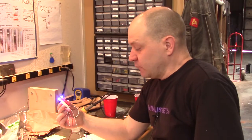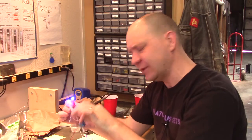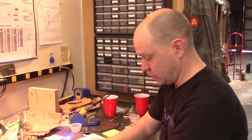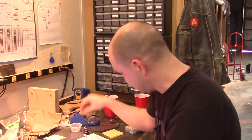I think I got it. In a series circuit, voltage has to add up to get to your power supply. We have 12 volts to work with, so we're going to do two 3-volt LEDs and one 5-volt relay - I'll be adding resistors later. They are all in series right now, and when I break the circuit the lights go out and the relay quits firing; circuit it up, the lights come on and the relay fires. What this means is that on my 4-pin connectors, instead of just three versions, I'll be able to do 12 unique keys - pin 1 to 2, 1 to 3, 1 to 4, 2 to 3, 2 to 4, 3 to 4, and all those same things backwards because LEDs won't let current go through the wrong way. So it's a win-win.